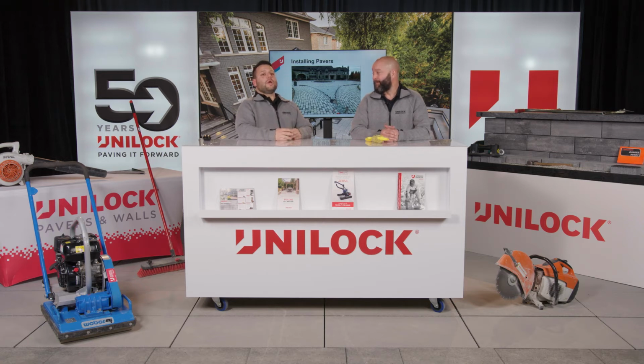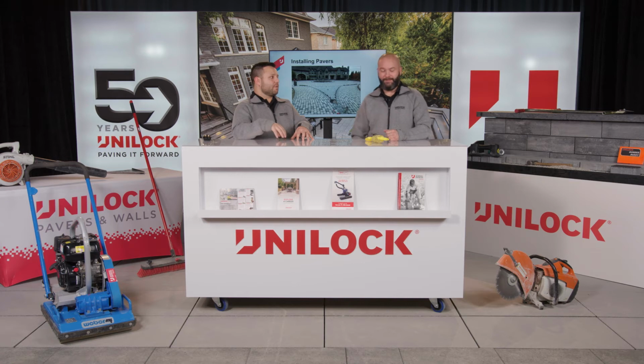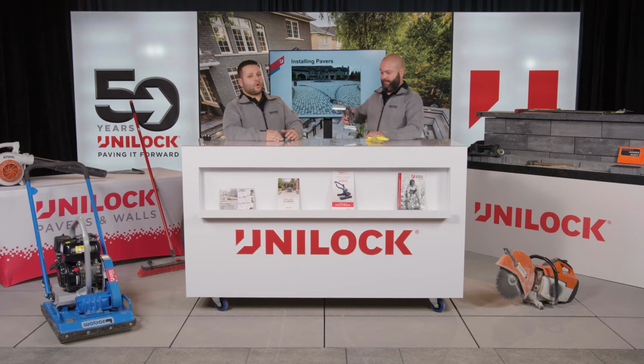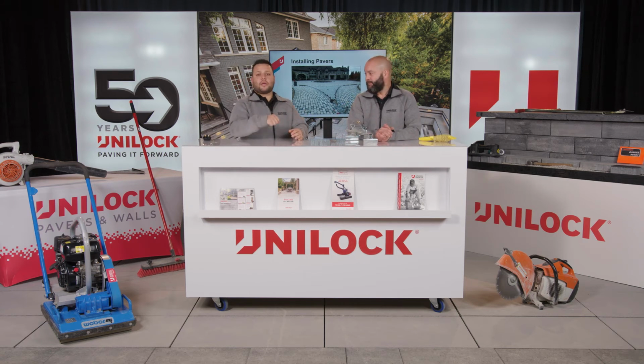Yeah, so Jay, at this phase, before we start to install our edging and our sanding, which is where the project's going to end, we really want to take a final walk and be really selective about the pavers that are on site. This is probably the easiest time to replace a paver. So if the blending's not quite right, or if something got stained during construction or isn't going to make the cut, we've got a couple tools here to make really quick and easy lift and replacements.